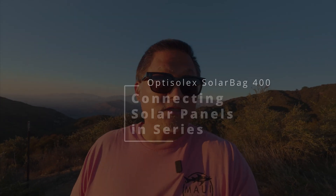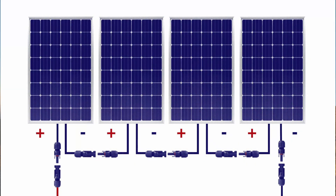Next we'll talk about series connections. Here you connect the negative of the first panel to the positive of the second panel, and you can continue adding panels the same way — sometimes called a daisy chain connection. In a series setup, voltages add up while amperage stays the same. Four 100-watt panels in series will output about 80 volts, but max current remains at about 5 amps. This approach doesn't require special junction boxes, so it's simpler. Series wiring allows for smaller gauge wire since higher voltage means less current. However, it is less shade tolerant — a single shaded panel in the series can drag down the entire string.